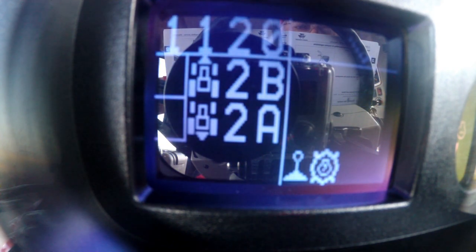Then the last screen is brightness and contrast — you can change those to match the level you need. Now we're back to the home screen. We can see auto neutral is on. On your right-hand console you can adjust between joystick mode and foot pedal mode. In foot pedal mode you're going to see the engine RPMs, the foot pedal sign, and dynamic tractor management that tells us our engine speed level associated with that transmission operation.